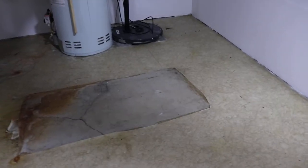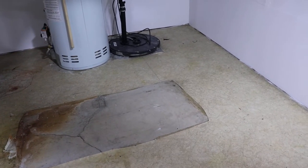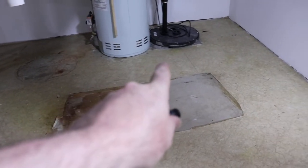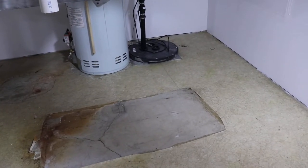Don't go running in and ripping out stuff. You can see some has been removed and they've left the asbestos paper behind. Someone also put in a sump pit here, and they would have had to cut out the flooring to do that. So that's one, two, three people who have exposed themselves working on this stuff.